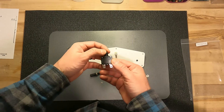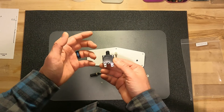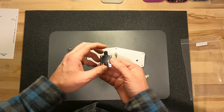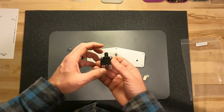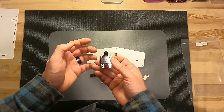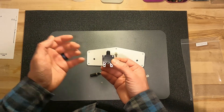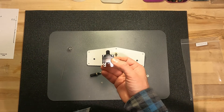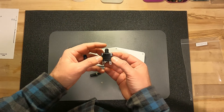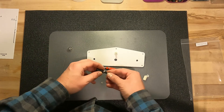These are pretty handy — they save you from having to buy fuses. If it pops, it just sticks up and you can reset it and go. If it happens more than once consecutively, I would recommend checking the track and the wiring — it's typically the car causing it. A lot of times when you have people over for races, somebody might throw something on the track they didn't test at home, and this is a safeguard so it doesn't destroy anything.